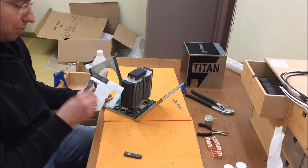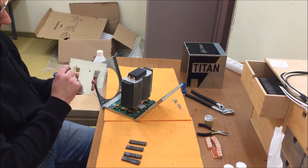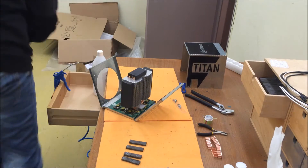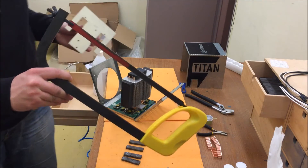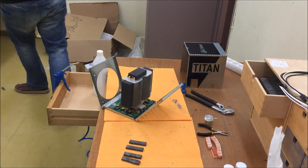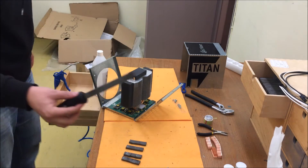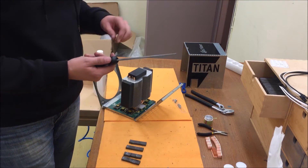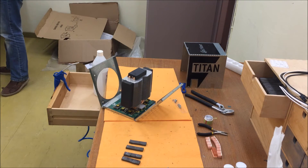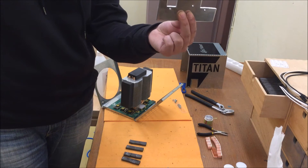What we'll do is first take away these thermal pads. I will cut here and here using an ordinary cutting tool. After cutting, use a deburring tool to make sure there are no pieces of metal remaining on the side — just clean it up. Now half the work is done with the cutting. I cut this side and now I'll cut in the same way on the other side.